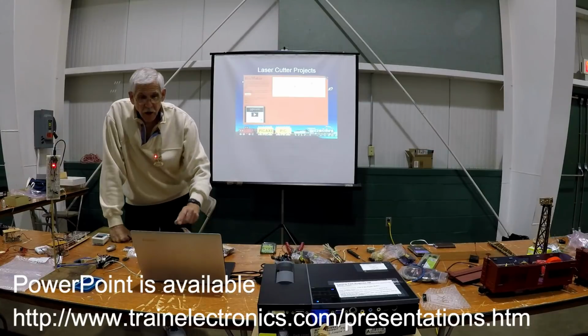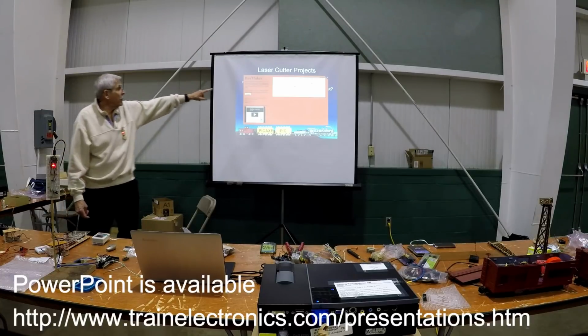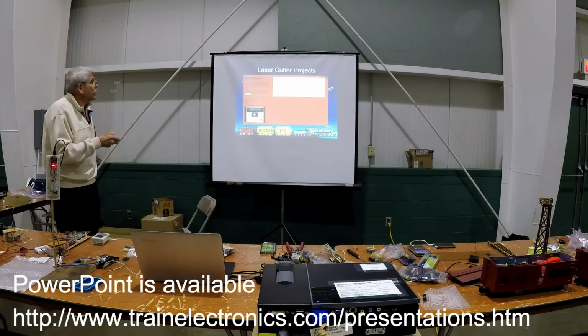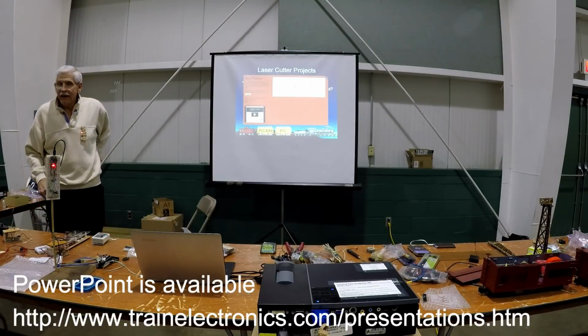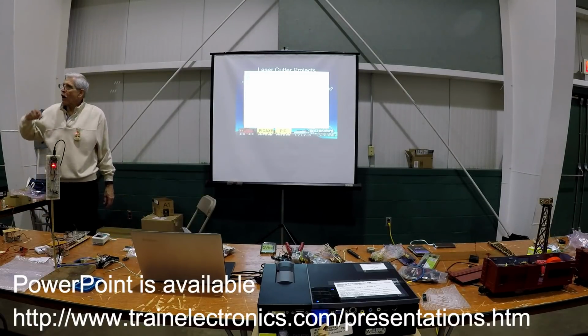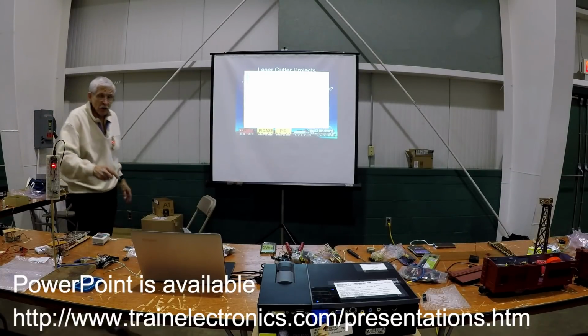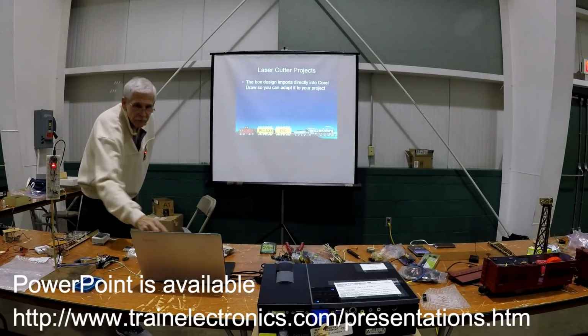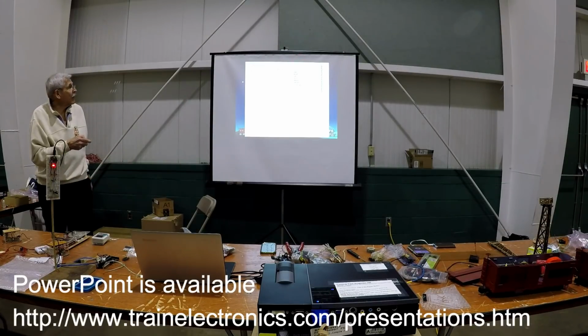But there is a website called Boxmaker. And you go into boxmaker.com and you type in, I want a box, I want it in inches, I want it to be 4 by 5 by 6. My material is 0.1875. And you click on Design It. It sends you a PDF that looks like that. Corel Draw will accept a PDF precisely. No debate. Then what I do in Corel Draw, I cut a hole for the clock, and I etch in the year, month, day, and so forth, these numbers, holes for access, and cut it.